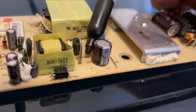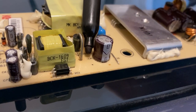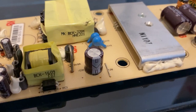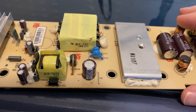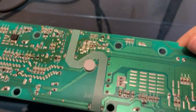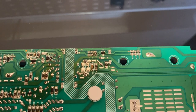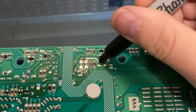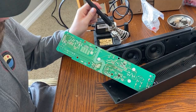This is the bad one, and it wasn't that significant on mine — I actually had to use a voltmeter to figure out where the power wasn't getting through anymore. But that's the one that continues to fry on mine, fried twice now. When you flip it over you'll see where you have to solder, where the capacitor is soldered to the board — those two little spots right there.